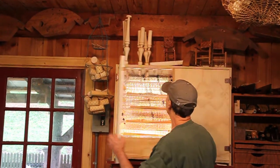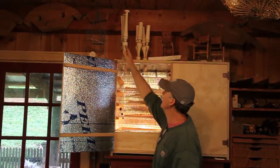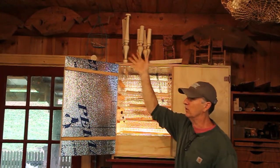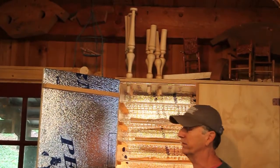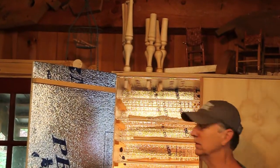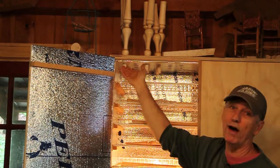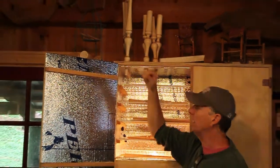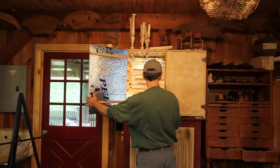If you can see right here, there they are sticking down. So I'm drying the tenons but not drying the mortise up here. So the mortise is staying at EMC, whatever that is this time of year. I don't know, let's say it's 15 to 18 probably, something like that, which would be just perfect. And down here we're below 5, you know, 3 or 4 or something like that. So I'm going to pull these out and then ream them in.